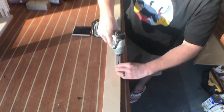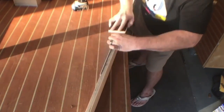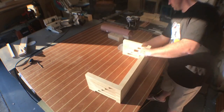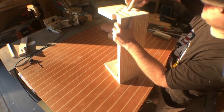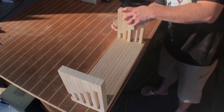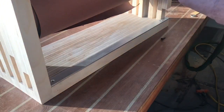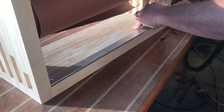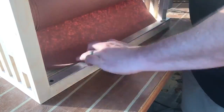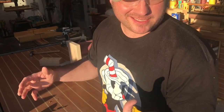Using the holes I drilled, I'm attaching the aluminum to a scrap piece of plywood and sanding it down with metal sandpaper. Before I assemble everything, I'm doing some light hand sanding over the whole piece, breaking all the edges and making it nice and smooth. For the spacers, I'm using a section of brad nails — it's going to hold the aluminum up and give me just enough space for the paper to fit in between the aluminum and the wood. Let's go ahead and do a trial run before we finish it with spray lacquer.